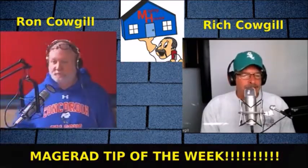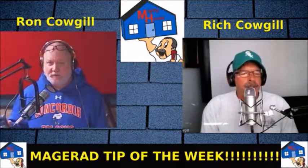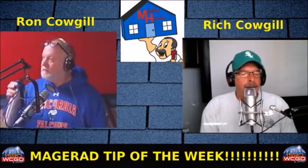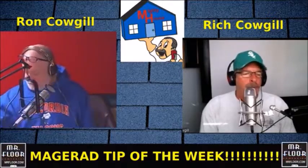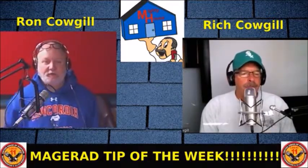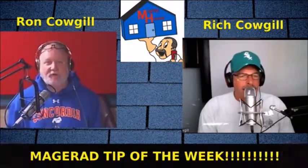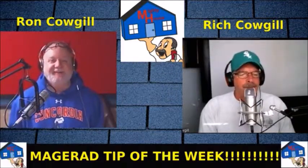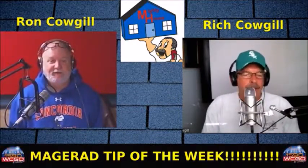Not securing or preparing the job site before starting is another mistake. When you start working on your house, you need a clean, dry, secure place to put materials — you don't want them outside in this weather where they freeze, thaw, and pick up moisture. Also, don't assume a truck can get where you're thinking. Trucks loaded with material weigh a great deal and could end up destroying your yard, driveway, or ripping out wires that go across your driveway. You have to think through the size of the vehicles doing the work.